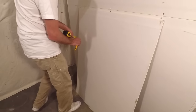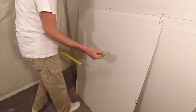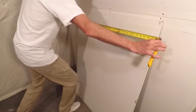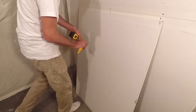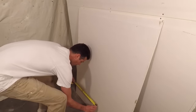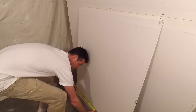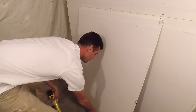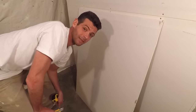I can also quite accurately cut freehand — I do that all the time because I always forget my T-square. I can pretty easily go up to about three and a half feet and get a decent cut. When I get down to the very bottom there's about three inches left that I can't reach, so I just stand over it, eyeball it, and cut up that three inches — or you could have a T-square, that would be easier.